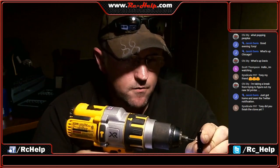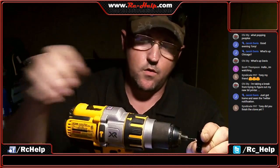Alright. Got my starting hole so I can bring it back up here for you guys. Yep, you guys can see that. So now, and whenever you're having to hold it like this, go slow. If you want, you can turn your clutch down. I'm going to turn it down to 1. That way, if it grabs, it'll stop. And on this one, being brushless, it stops really good.